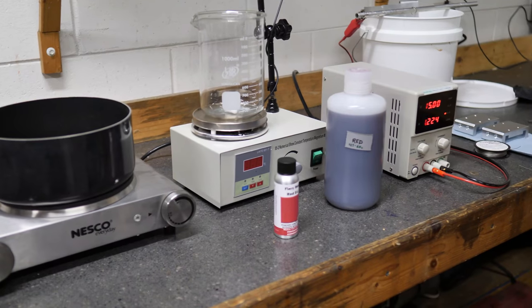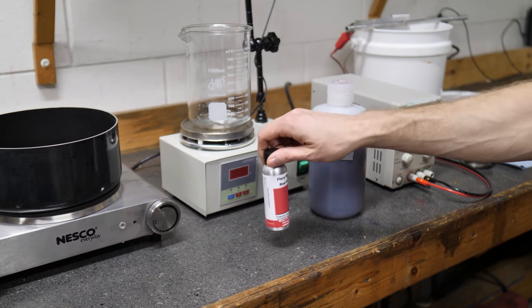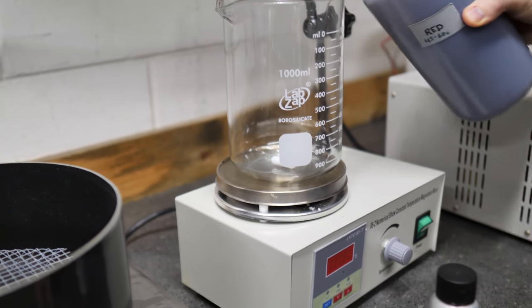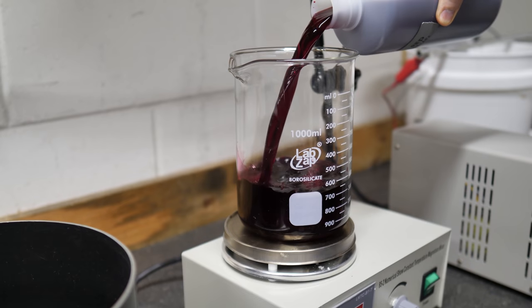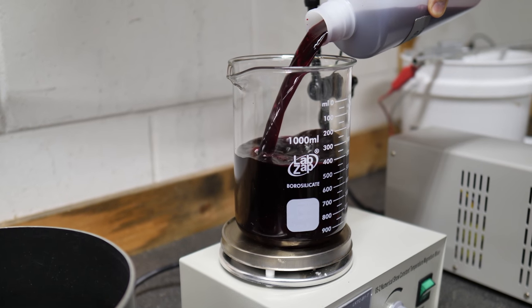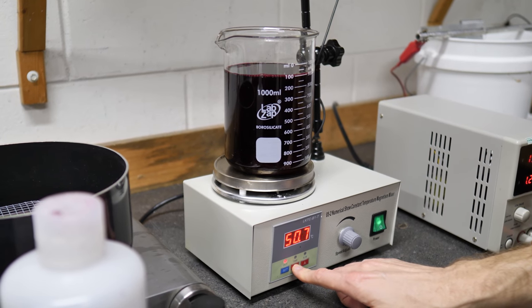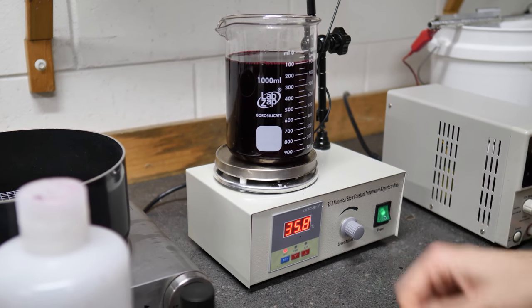You can also dye it pretty colors if you'd like. Before it's finished anodizing, mix up some dye. Get real anodizing dye — some people have gotten away with using clothing dye or something else, but there are never good consistent results with that. We've linked to the Amazon page in the description for the dyes we're using. The ratios are different for each one, but it's some amount of dye powder and clean water. Start heating the dye to the temperature listed on the bottle.